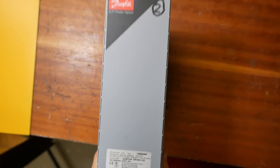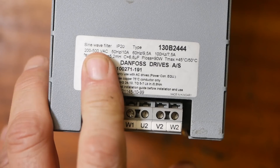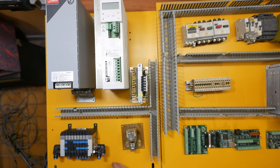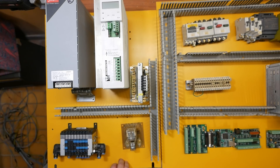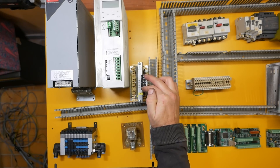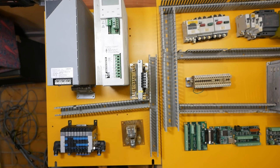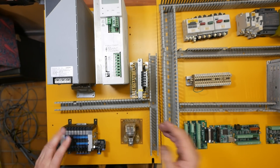So this is a Danfoss sine wave filter — the one that goes between the VFD and the motor. After a couple of days of analysis paralysis I think I've got the general layout pretty much decided upon. This back plate goes right deep into the cabinet and gets three-phase power through the line contactor into the main motor inverter. Power then goes through the sine wave filter and out to the main motor. Down the bottom is pneumatic control and variator control.